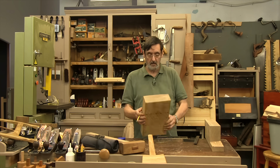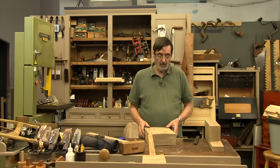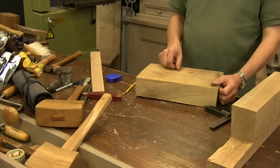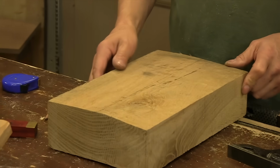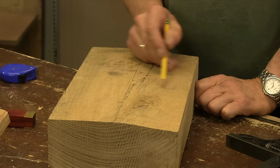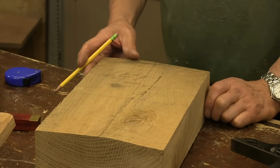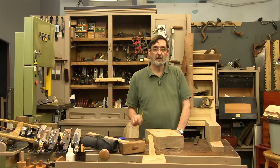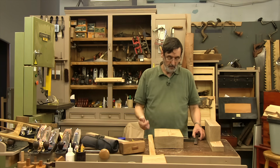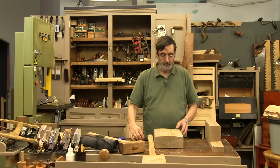You can do it, and there's nothing wrong with you wanting to pursue that, but I'm going to cut this on the bandsaw, and then I'm going to also cut this across here on the bandsaw, and then this one here, I think what I'll do is I'll do this a little differently. I'll go across here first with the bandsaw, then I'll go down here and I'll get my 2 guaranteed mallet heads, and then on this one I'll split this in 2 using a maul and a chisel hammer and an axe to get me down this section here.